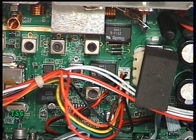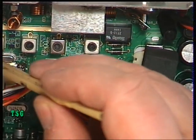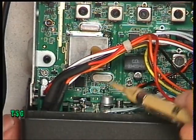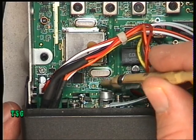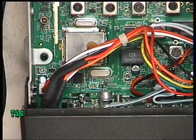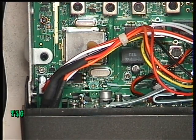So we've got a single adjustment for the transmitter, power adjustment, frequency set, and deviation. There you have it — the TTI TCB900 transmit side. When we're in touch we will align this side.